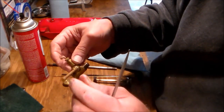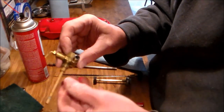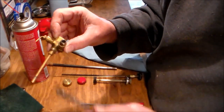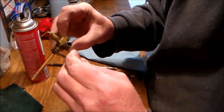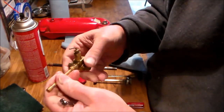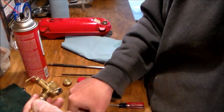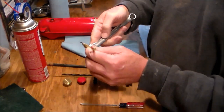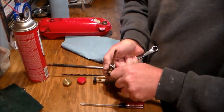What we're going to do is clean this a little bit. On this valve there's a little nut right here — this is where the 5/16th wrench comes in. You can take the 5/16th, put it on here, and pull this assembly off and clean the inside of it. We'll do it this way — half-inch wrench, 5/16th.